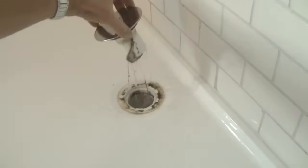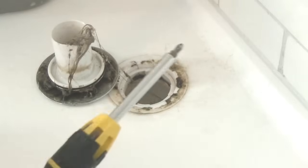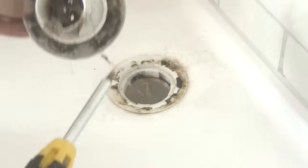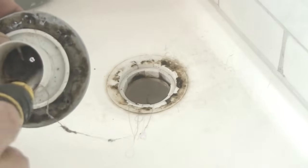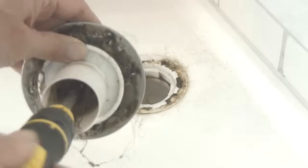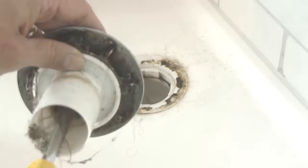Standing water in the shower basically means you need to get your shower waste clean. So we're going to take the cover off the waste — and look at that, not very nice. The first thing I'm going to do using my screwdriver, which has got the Phillips head PZ2 attachment on it, is reach into the shower waste itself. It's going to be really hard to pull all the hair and stuff out without taking apart the cover off the top of the waste, so I'm putting my screwdriver in the middle and undoing the screw that attaches the white plastic part of the waste to the chrome effect cover.